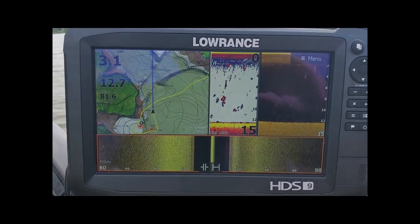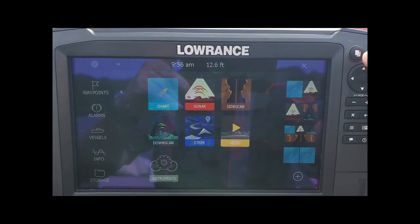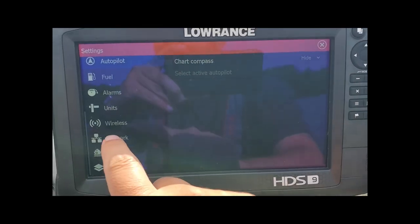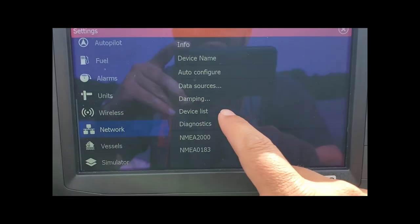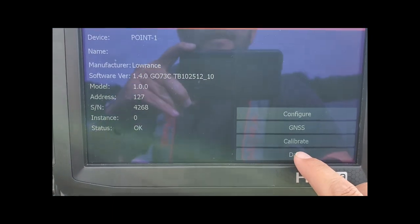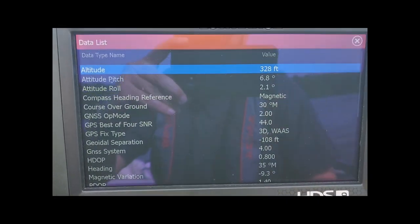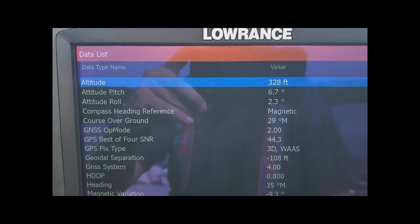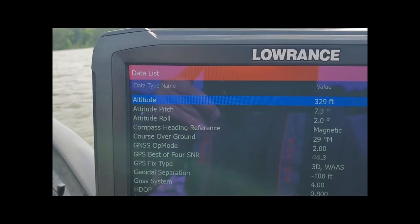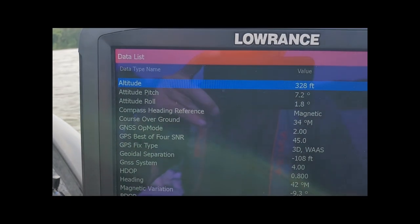At this point, take the boat home, back on the trailer, put it in your garage or any area you can work on it safely. Jack it up with a jack or pull it up with a winch to get it back to that pitch — for me that was seven degrees. Then adjust the transducer so it's reading level. That will replicate that seven degree pitch when you're back in the water going three to five miles an hour, giving you the best possible picture. I hope this was helpful — please feel free to reach out, leave a comment, and I'll see you on the water!